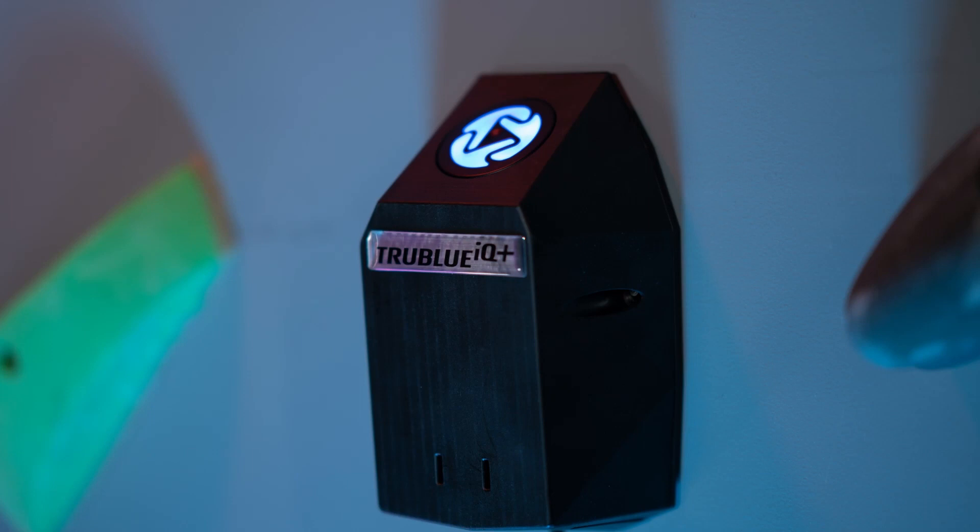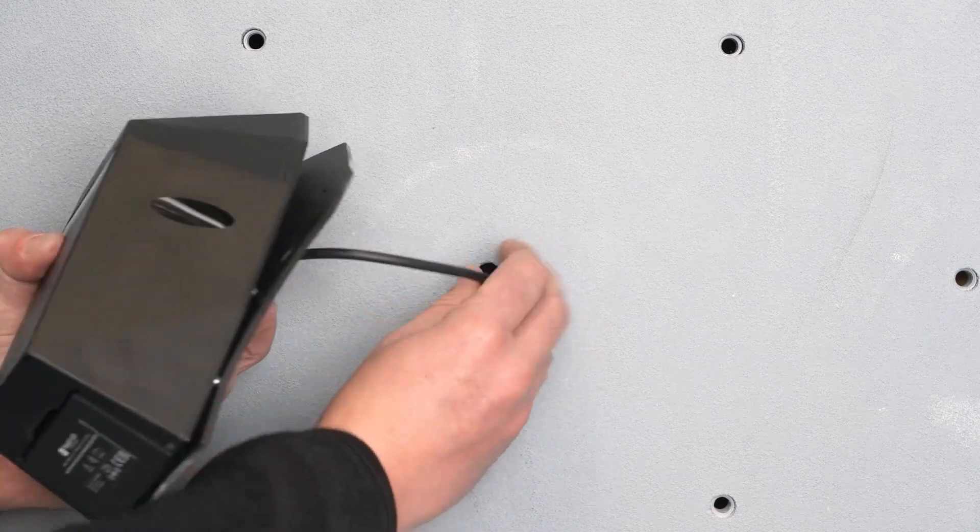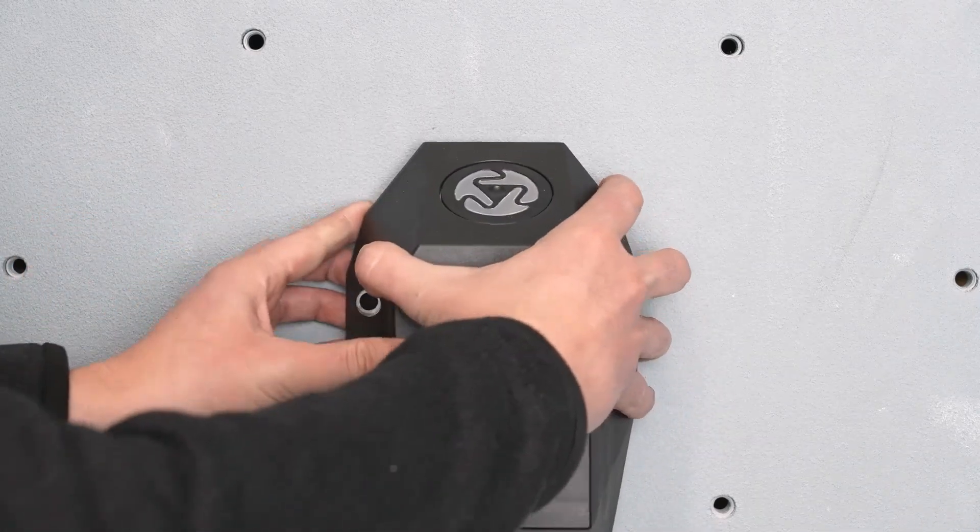That's it for the upper section. Now we're going to head down to the base of the wall to finish the installation. When mounting the base button, you want to find a flat section of wall that's within easy reach of the ground. For the base button, you will also need convenient access to the battery pack, which slides out underneath the main assembly. When you're installing the base button, make sure that the battery pack is not connected — all of the cables should be installed and connected before you plug into the battery. If you have access to the back of your wall, you can remove another T-nut or drill a new 7/16 inch hole, then pass the base cable through to the back. If you don't have access to the back of your wall, you'll have to cut a hole in the wall that the base button will then cover up. The maximum hole size is 90 millimeters wide by 150 millimeters high. Before making any cuts, use the base button backer pad to ensure the base button will fully cover the access hole.